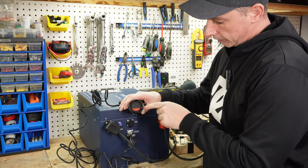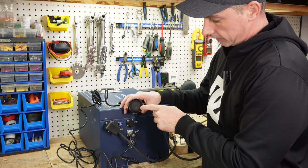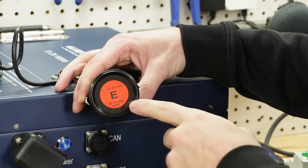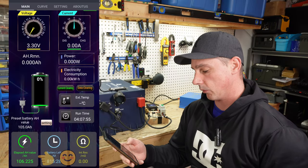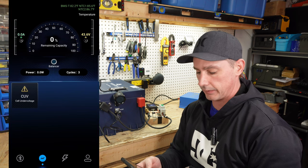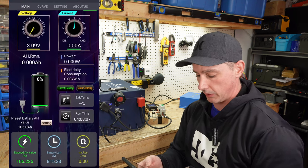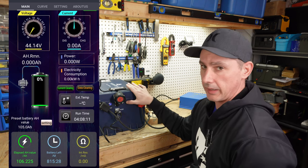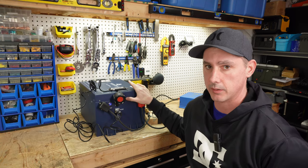The discharge test is almost complete and the display has now changed to a red color, signifying 'E — Recharge Now.' Discharge test is concluded. We are at 106.25 amp hours, and on the app we can see we had a cell under-voltage event. That's pretty good — we got 106.25, which is over an amp hour more than the specifications. This test is a pass. They're using good cells.